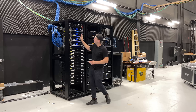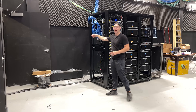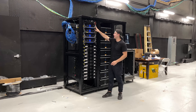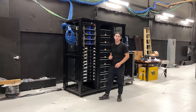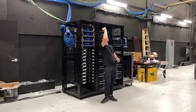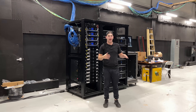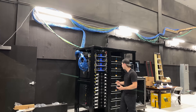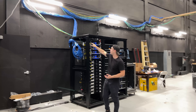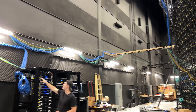The NovaStars have Ethernet — see all this blue cable coming out the back? That is an individual Ethernet for about 8 to 9 panels per port. Each one of these has at least 13 or 14 ports being used in the back. 13 to 14 cables times four have to get all the way up to the ceiling, and of course we need enough slack for that ceiling to drop down without all the cables getting yanked out. All the colorful cables — those teal, yellow, and black cables — those are all fiber, and those are for the Bromptons going over to the XDs.